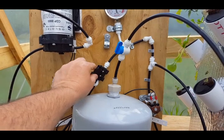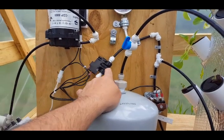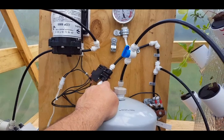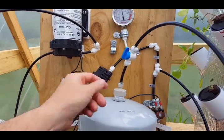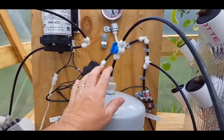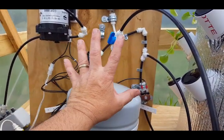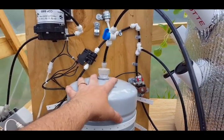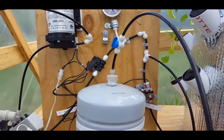The switch has an adjuster — it's factory preset. I got this one at 80, which seems to be a little more stable than the one that was at 40, and then I adjusted it up. That's how we hold a high pressure so that the mist heads can always deliver that fine mist.